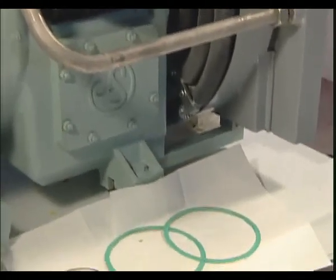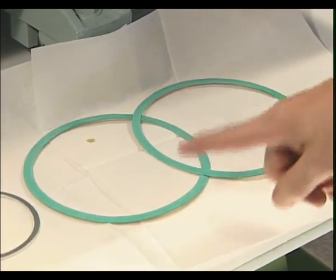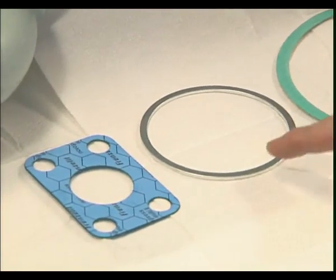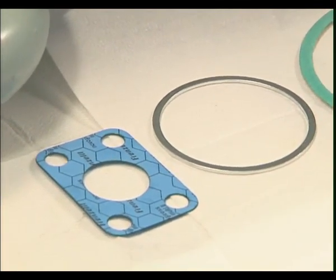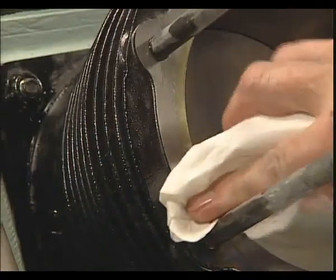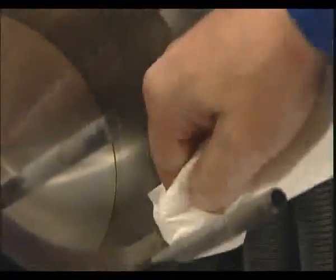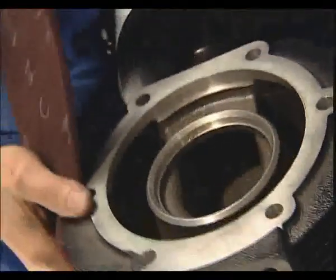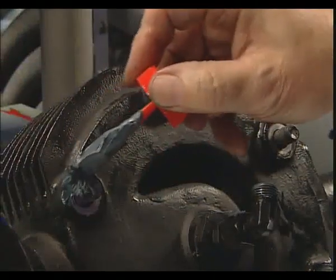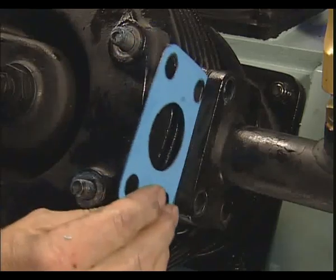During installation of new or reconditioned valves for the first stage, four new gaskets are required: a flat gasket under and over the valve, a precision gasket ring on the concentric valve, as well as a flange gasket between cylinder head and cooler. Before the installation of the cylinder head, the gasket surfaces and the inner spaces within the cylinder have to be thoroughly cleaned and oiled once more. In order to make dismantling easier, all threads are to be oiled or a hot screw paste used.